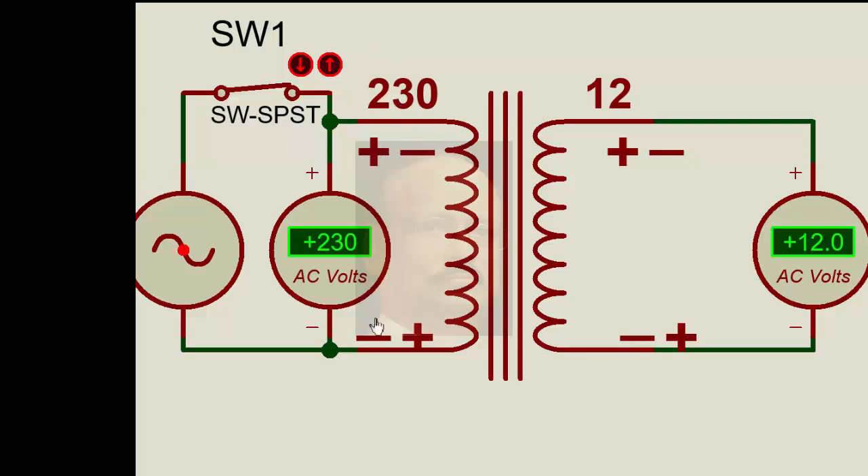You can mark here plus-minus and minus-plus. Actually, there is nothing like plus-minus in a transformer or in AC — it is called polarity. But for the purpose of better understanding, we indicate that in the positive half cycle this side will be positive and this side will be negative, and in the negative half cycle the same side will swap. This happens every 10 milliseconds, because of the total 20 millisecond time period of the 50 hertz cycle.